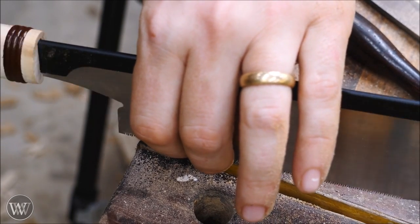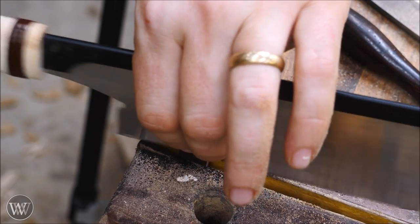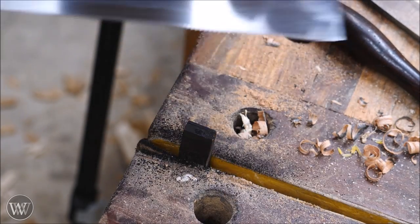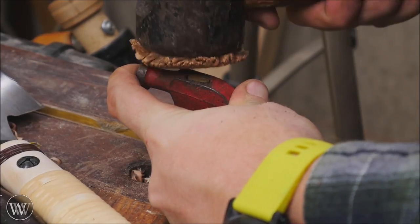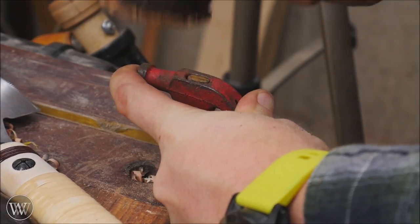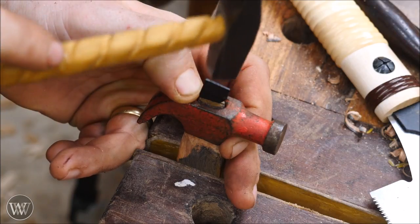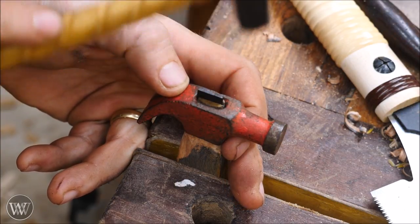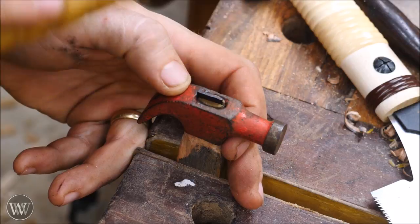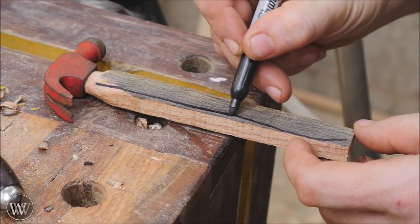With a little bit of careful cutting, I cut this tiny little angle from about a sixteenth of an inch wide at the top down to zero at the bottom. Then we can drive on the head and fit in the wedge. Once the head is on, it's just a simple matter of tapping it in — I figured it would be kind of fun to use the other mallet to drive in the wedge for this hammer. After that's done, I can cut it off flush and then it's time to go on to shaping the handle.